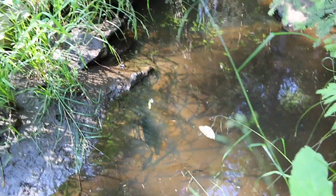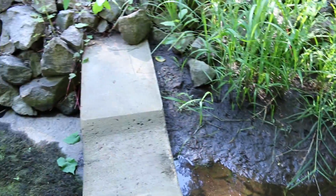And like I said, when it rains really hard, the water goes over the dam, and this is why I ground the ridge here. It's just so the water flows in the center of my concrete dam, so it doesn't cause erosion on the side. See this side here.